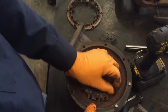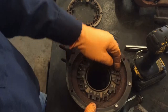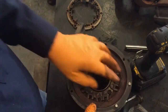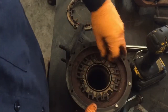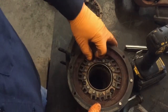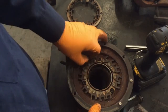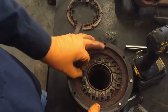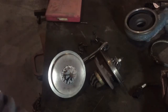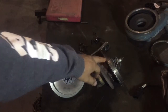The problem with this one is all these little pegs are stuck. Water went into the EGR cooler, messed up — water went into the turbo, rusted everything up, and these are all seized — well, not all of them, but most of them are seized. We're going to have to clean this up and see if we can free up all these and hopefully salvage this turbo.